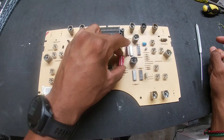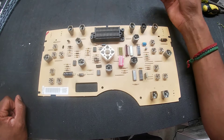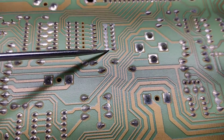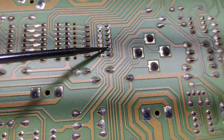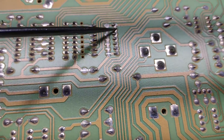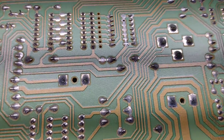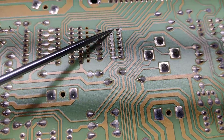To make the cluster work with any setup, you can replace the seven fuses with a seven-position dip switch setup. It'll have 14 pins that you can solder directly to the board. When you flip the board over, these are the fuses that need to be desoldered, and the dip switch will be connected here and here — because if you look closely at the traces, this row and this row are connected top and bottom. So when you put the dip switches in, connecting one row of the switch on each side, you essentially have the same configuration. So what I need to do now is desolder these fuses out.